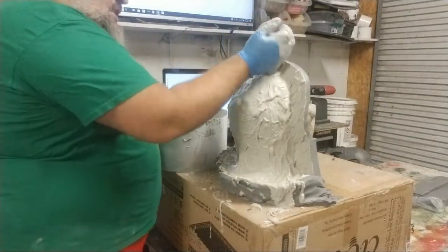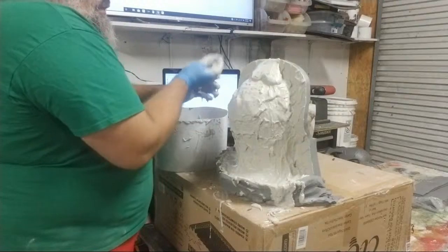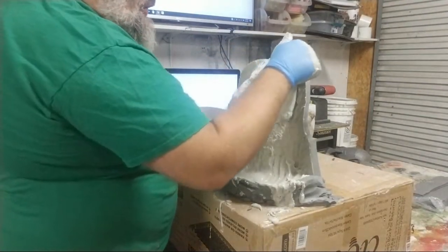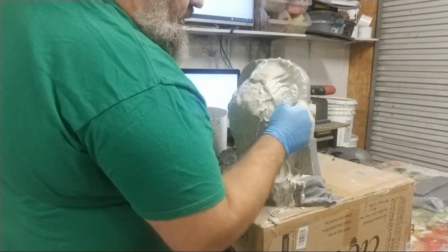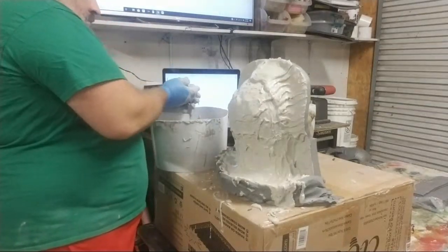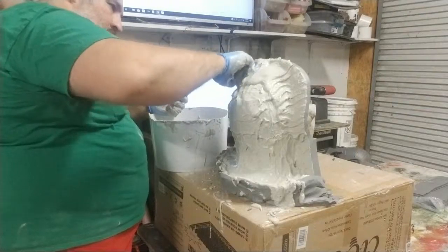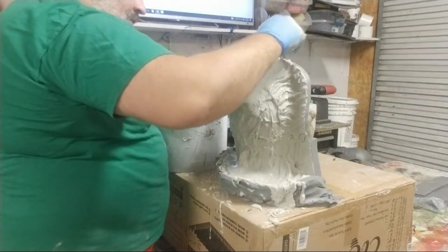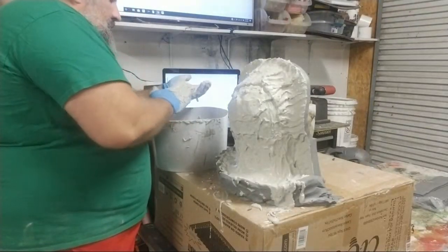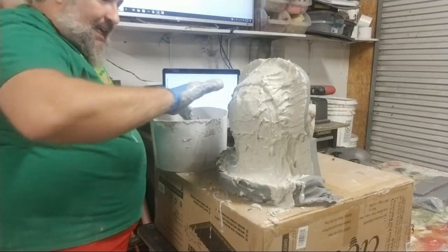Not quite at this stage yet. But I can use the mold wall to scrape it off of my hand. Really build up a good thickness. Can you start mixing more? No, not yet. UltraCal kind of likes a break in between layers. HydroCal wants you to do the mold all at once. I'm just putting it on the back of my fingers.